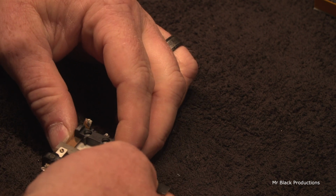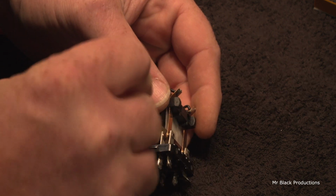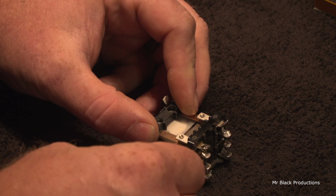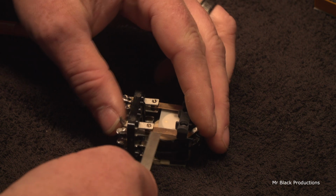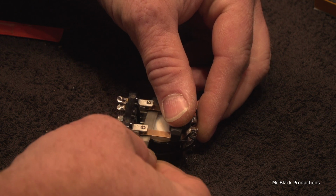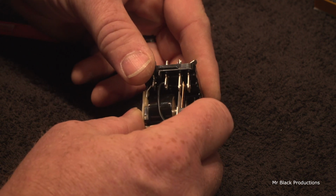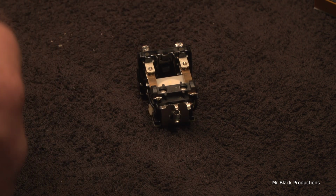So what I'm basically doing is, this is a jade embedded rod, or there's just enough abrasion material embedded in this rod to where I'm polishing the contact points. And I'm doing this with just the smallest amount of pressure. I'm not in here jamming my fingers down on nothing. We're just burnishing these contact points to make sure that they're clean. Small little circular pattern and back and forth, back and forth. And that cleans up the contacts on the relay so they can make nice, smooth, linear contact, increase our amount of surface area, and get rid of our carbon arc scoring that comes from the relay keying up.